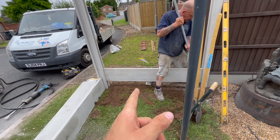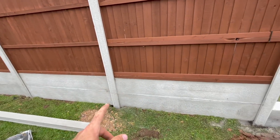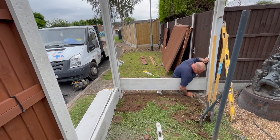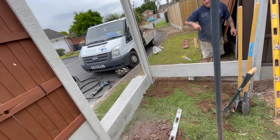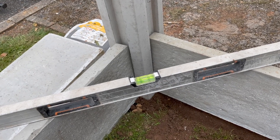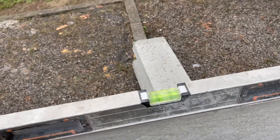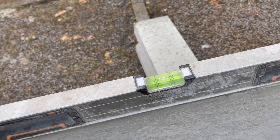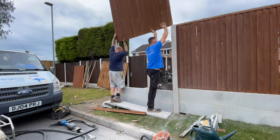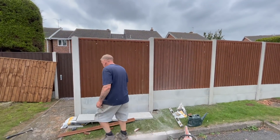We're just setting the level of that ground to match this gravel board here so the 90-degree angle goes with each other. We did a little drop there and a little drop there to match just there. It is coming along - we'll get this bay in. What's that in a panel? Too good not to show you - level to level, and level. Back to this panel, let's get it in. She's slid in lovely - Taff's done a good job there marking that panel out.